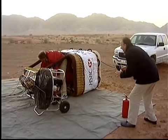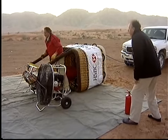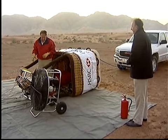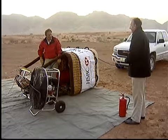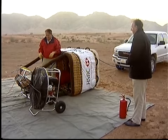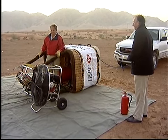Alan, you're inside the basket at the moment getting the balloon ready for our flight. So how do you start assembling this? We start basically by rigging the basket first, put in the fuel tanks, rig the burner systems, connect everything up. Then it's a matter of doing the pre-flight checks — making sure tanks are obviously full of fuel, check the pressure, check the burners are operating properly, put in all the flight instruments that we need, put on the tether line to the car just to restrain it during the inflation process, and then the guys are just setting up the balloon envelope prior to cold inflation.